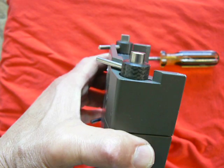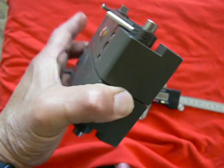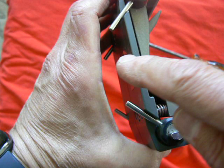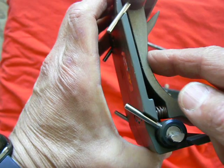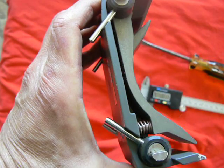If the track is out of adjustment, you can use a flat head screwdriver and change these screws until you get 14.3 to 14.4 millimeters between these two. Hope that helps.